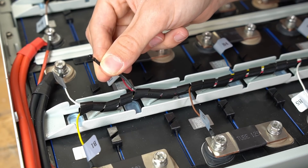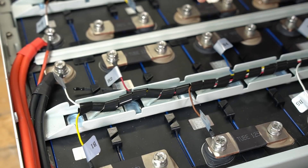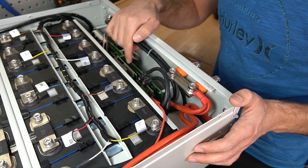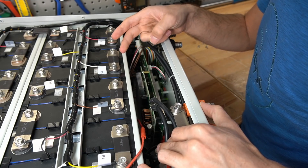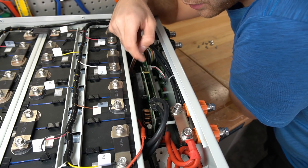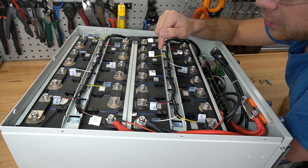There are four temperature sensors, and they're going to use a potted ring terminal — this is the first prototype so they hadn't connected those yet. Plastic separators between the cells look similar to the EG4 battery. On the main terminal side, there are 10 copper bus bars. The BMS can handle 100 amps in and 100 amps out — we tested this by pulling 104 amps for 20-30 minutes to charge a Tesla. This BMS is used by Seplos, EG4, and many other companies. It has current regulation, multiple temperature sensors, programmability, and communication.